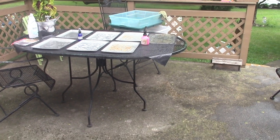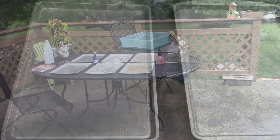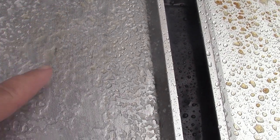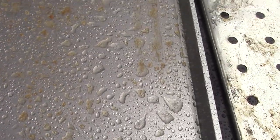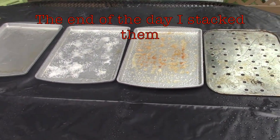We're back outside after an hour — I'm standing against my house because it's raining. Looking at the water pan, there's a little bit of rust, and I think it's because I sanded it — I can see it on the scrape marks. The kosher salt and vinegar pan shows very light, barely visible caramel coloring, which surprises me; I thought the vinegar would do more. The peroxide pan is doing amazing things. I've stacked them two and two and two, and we're going to leave them until tomorrow.